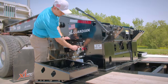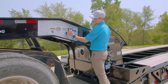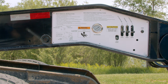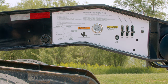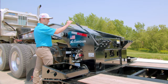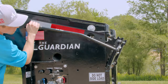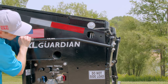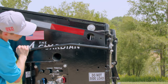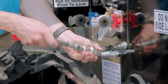Then start your hydraulics. Next, use the gooseneck support arm control to raise the gooseneck support arm up into stored position. This will take all the pressure off the tractor and will put it all on the main deck. Then, use the trailer's lift control to raise the main deck and allow the rear of the gooseneck to clear the ride height blocks. Rotate the gooseneck adjustment handle forward to swing the ride height blocks under the rear of the gooseneck. At this point, choose which ride height position you need according to your load. Stop the hydraulic supply and reattach all air and electrical connections in the control panel.